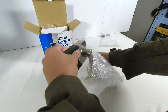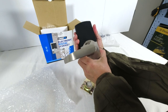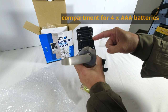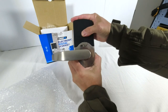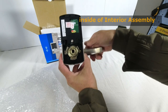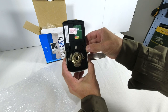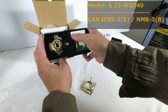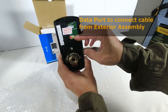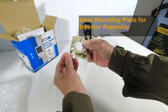This packet contains the interior lock assembly — the lever, the thumb turn. If I lift up this black plastic cover it reveals the slots for the four triple-A batteries to power the unit. There's a sticker which says 'warranty void if this component is disassembled,' and a sticker showing the model number A33-WG040. There is the socket that takes in the data cable from the exterior lock assembly, and this is the steel mounting plate for the interior assembly.